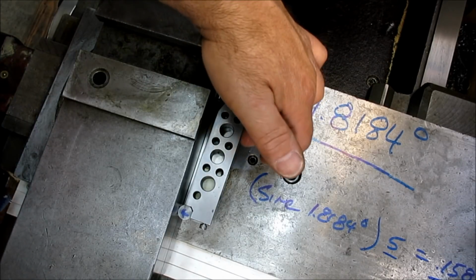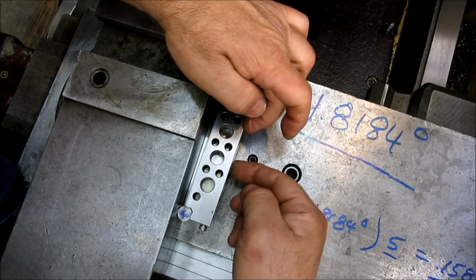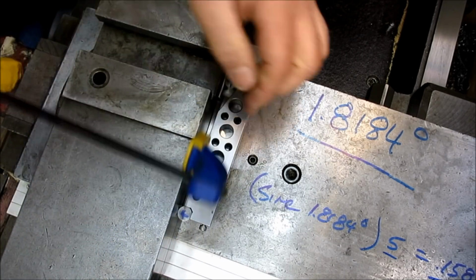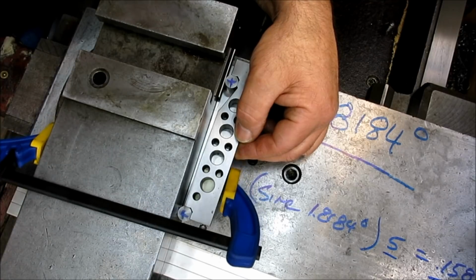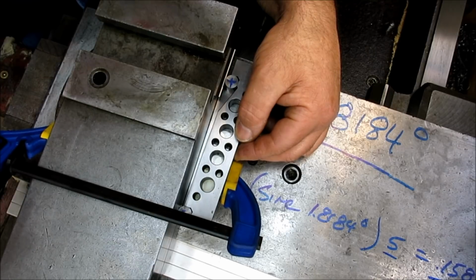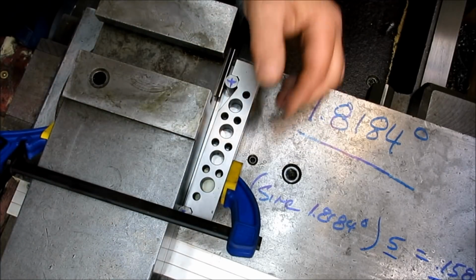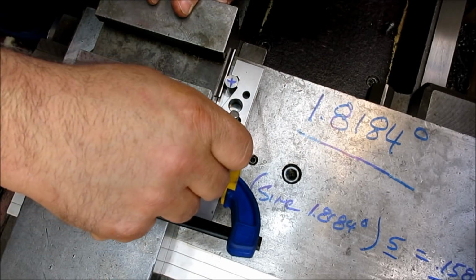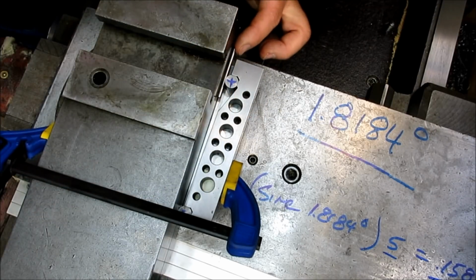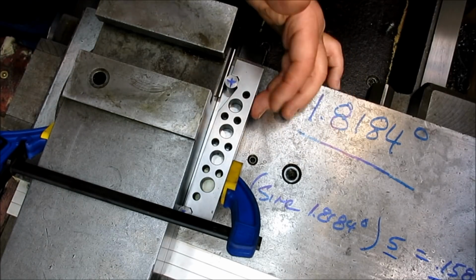compound. Okay. So now it's not clamped, but it's loose, which is not that cool. So what I'm going to do, I'm going to use a Johnny Woodworker clamp here, and I kind of like these actually because you can operate them one-handed. So what we don't want is we don't want anything to tip. So I'm looking under this rear roll here to make sure that it's sitting flat against the compound. And the other thing, I want to feel this and make sure there's a little bit of tension on that, which there is. Okay, so that's it. That's as much as I need to clamp that.